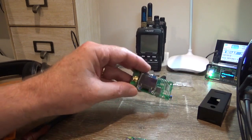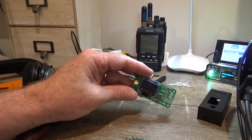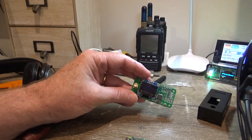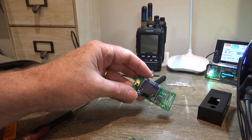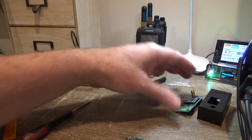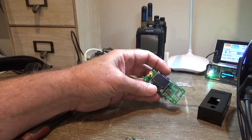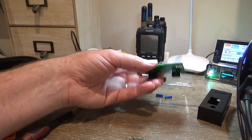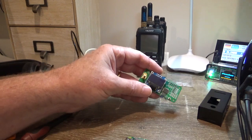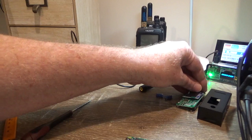eBay is the best place to buy a kit, but the unfortunate thing is they're all out of China and they're not tested — even though they say they are. There's an element of risk; I've had a couple that were dead on arrival. Make sure the description says the OLED display is soldered. Sometimes photos can be deceptive — one photo may show it soldered and the next photo it's not there at all. So just be careful of that.